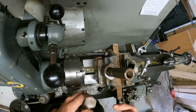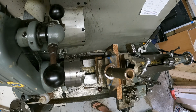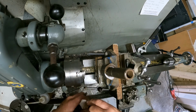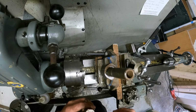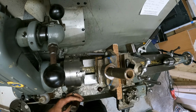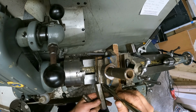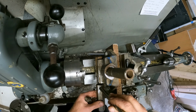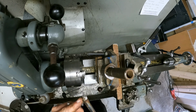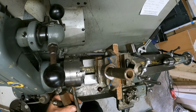And the idea is that once I've got the square stock, I would drill a hole down the center also with the lathe, and then maybe put a bolt or grub screw in there so that I could hold the piece of stock in there, and then you could just flip it over onto your 90-degree sides so that you could cut a nice and perfectly square key that will fit into the new chuck.